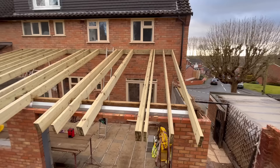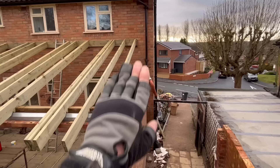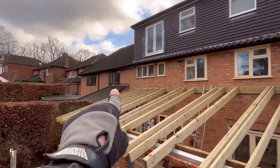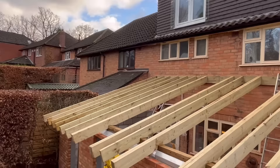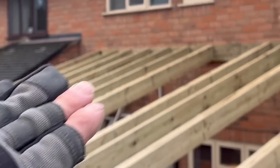Other than setting up a ladder frame over there — this side we're doing traditional, Ad's going to cut the bricks and lay them to the pitch. On the other side, rather than cut bricks unnecessarily and create more work, we'll do a barge board instead down the side of there. Ad can then cut his bricks a bit more crudely to suit the pitch, while this side needs to be cut exactly because you'll see them, like over here.